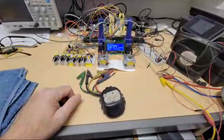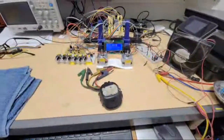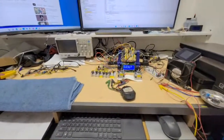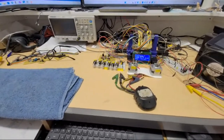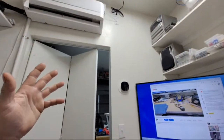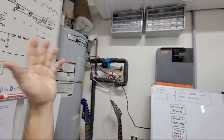And then there's another thing I have in there. A couple different situations. Say it is only calling for the water heater, which it is now, and not the thermostat. I have a low limit with it, because I put a wall sensor here and another sensor in the water heater, so my microprocessor knows the current temperature of the room and of the water heater. It has a high limit for the water heater to just keep rejecting heat in the water heater as long as possible, like overshooting my water heater's thermostat. Where that'll come in handy is when I need to cool the room. Go ahead and keep rejecting the heat into the water heater, using the energy anyway to cool the room. It's the same energy. Just keep putting heat in the water heater.